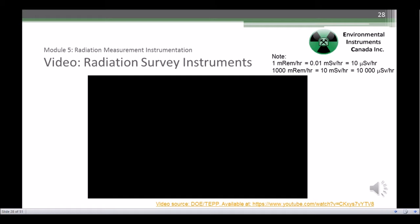There is some good information in the video. The mention of neutrons may be a bit confusing — you will see neutron sources with other meters, but the dose rate reading will not be correct. Even so, you will still have a yes-no indication. This video uses old units: it mentions 1 millirem per hour, which is the same as 0.01 millisieverts or 10 microsieverts per hour. It also mentions 1,000 millirem per hour, which is the same as 10 millisieverts or 10,000 microsieverts per hour.